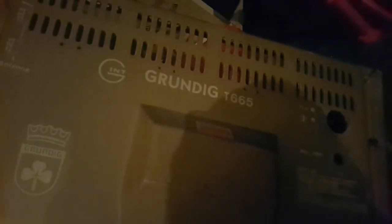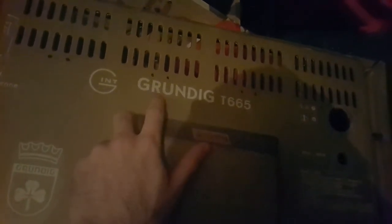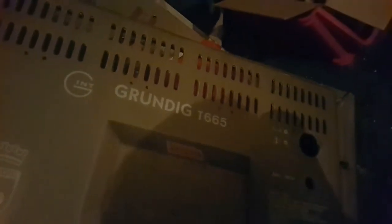So, someone more experienced than I pointed out, Grundig stands for "Gerät richtig umfangreich nachlöten, dann ist gut." Which means, resolder the whole device properly, then it is good. That reminded me, I have not checked for any dry solder joints in the thing, which is a real possibility, especially might explain an intermittent issue like we were having.